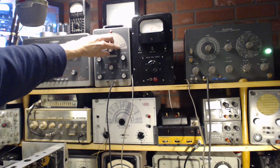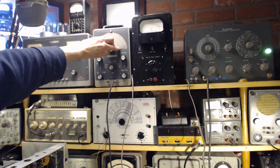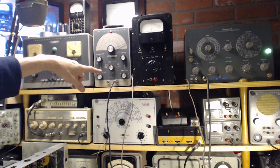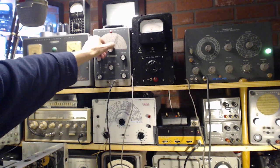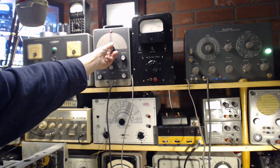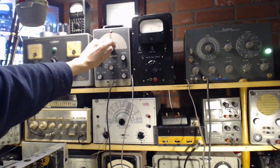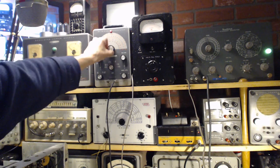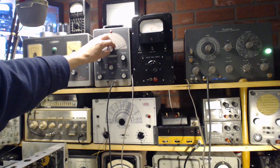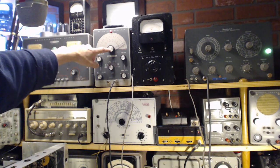So this is 108 up here, that's about 104 on there, but I'm sure it's actually putting out 108 because the receiver here is tuned to 108. What else comes out of this? That's probably exactly half. That's 50, around 55 there. Bit of dirt in it maybe. Okay, so what we've got is a signal generator that puts out 108, top of the FM band.